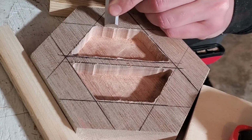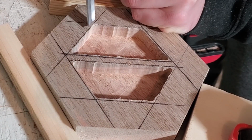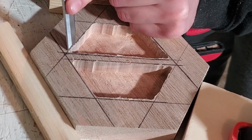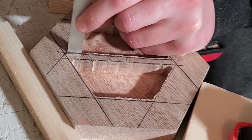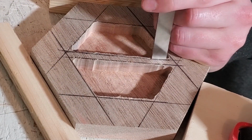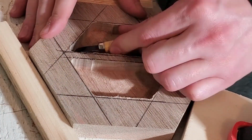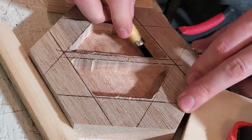One of the tricks I learned in my tinkering was to actually use your chisel to make a guide for where you want to be removing material. This ensures you keep a good line. Additionally, scoring where you want the chisel to end makes sure that you don't dig too deep into your workpiece.